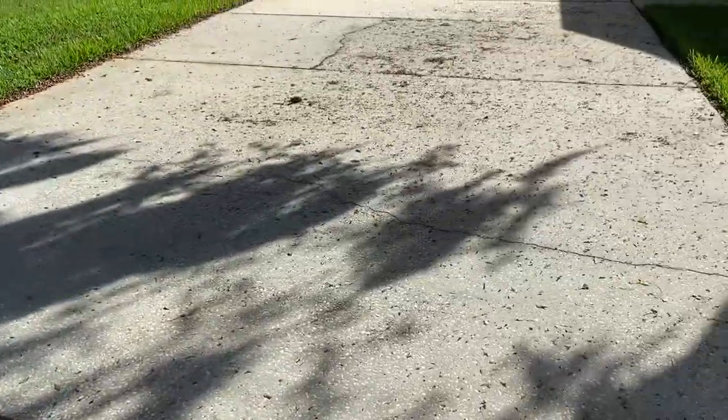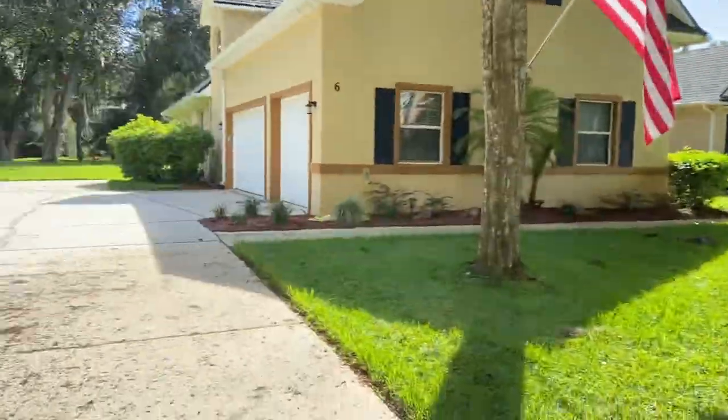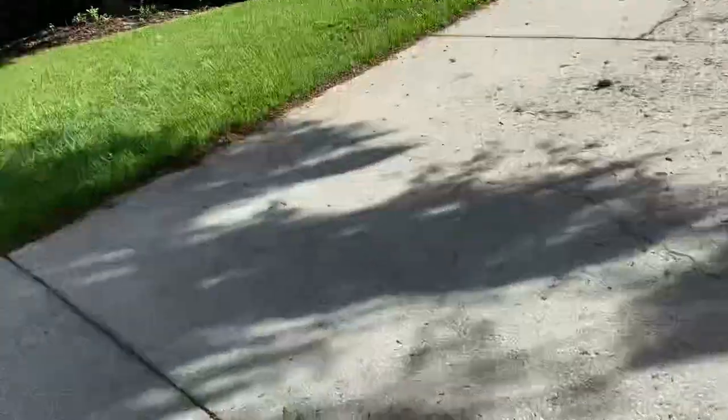Right now they want just the driveway done and the tannins lifted up. After I blow all this debris out, I'm going to scrub some of the stains with a hard bristle brush and let that soap and detergent sort of pull out some of the stain. I'm then going to rinse it down, pre-wet the driveway, and hit those stains with a little degreaser. I'll scrub those stains again with the hard bristle brush to really help pull out more of the staining.